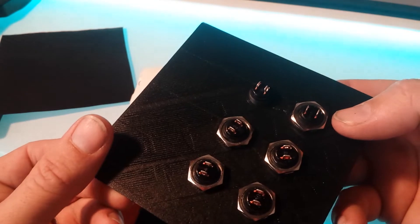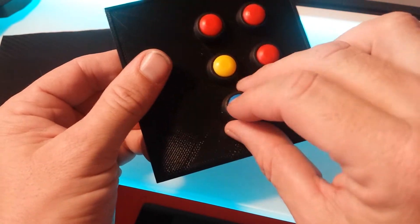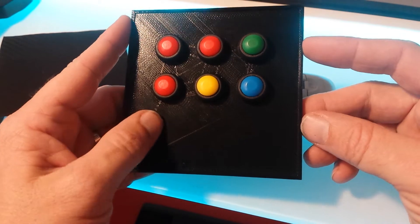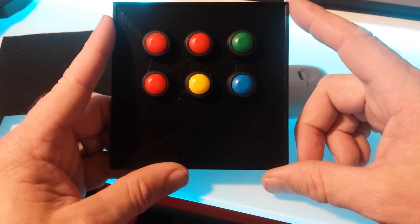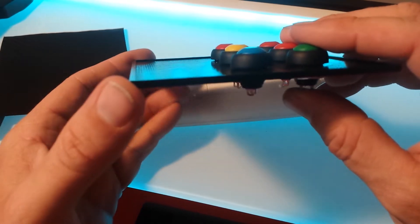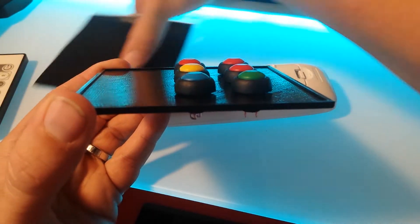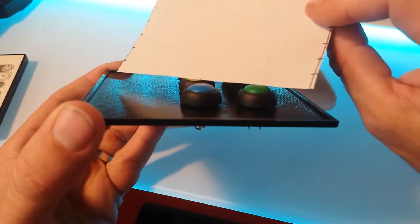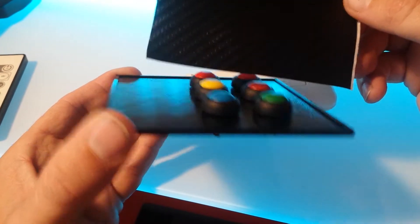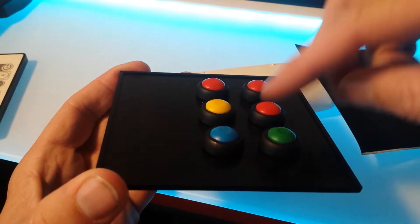This is a 3D printed panel with printed holes for basically slotting in a set of standard buttons. These will be configurable in different panel sizing. I'm thinking the 100x100 and 100x150s are a good sized panel for a number of buttons for putting together an actual cockpit. This has been printed to a 2mm thickness with a 3mm edging. The good thing about this edging is it allows you to take some contact — any kind of graphic. This is a 3M styled 4D carbon fiber look. Basically it's a sticker, but it fits quite nicely into the existing lip and will fall nicely into the holes.